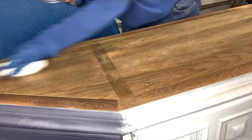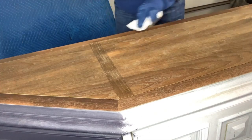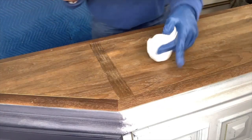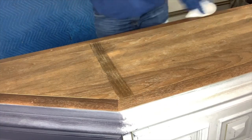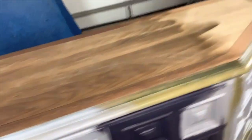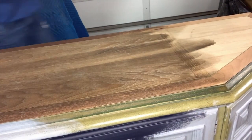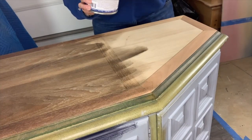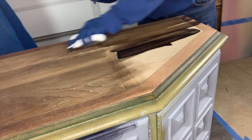I have a few areas here that are taking it differently — I'm not worried about that. I'm going to catch it on the second coat. See how the wood has trim in it — that trim is gorgeous. I'm going to go with the grain with the trim. I can't stop once I start this; you have to finish, because you'll have stop and start marks. I keep going, and you'll see how quickly I can get this all done. You can see I'm rubbing it into those grains and spreading it out.